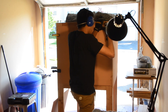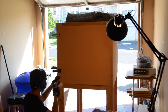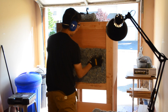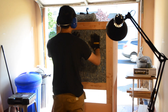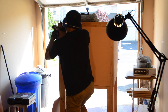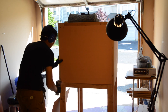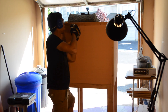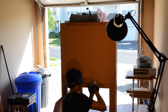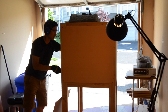I also wanted to insulate my walls for maximum sound absorption. My Shapeoko 2 enclosure had 3/32-inch thick acrylic windows, which is great for observation and filming purposes, but I wanted to double down on acoustic performance. Since I'm cheap, I chose 5mm plywood for the walls. I was hoping the denim insulation I'd selected would block out most of the sound. This insulation is the only kind I found that would fit in the 1.5-inch gap between my plywood panels — usually, rolls of insulation are designed for home use where your walls are at least 3.5 inches thick. I wanted maximum sound absorption but I didn't want my enclosure looking chunky, so my 2x4s were rotated 90 degrees compared to the usual convention in construction.